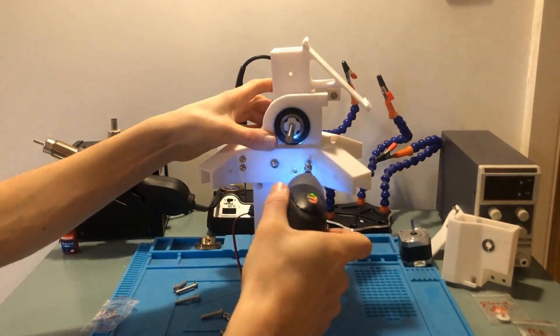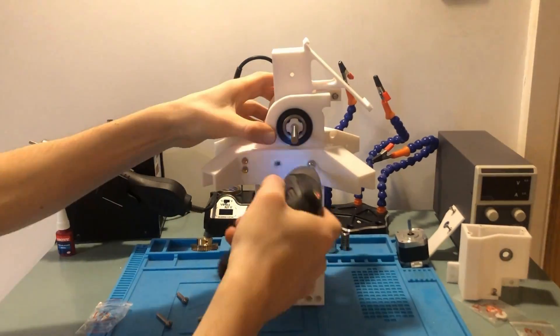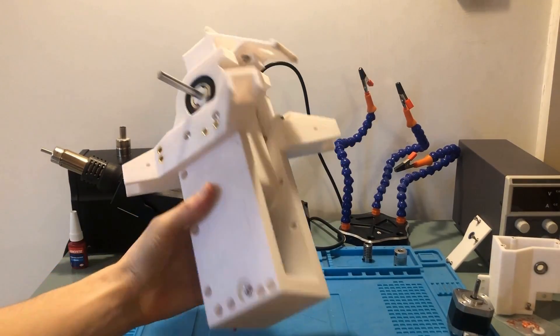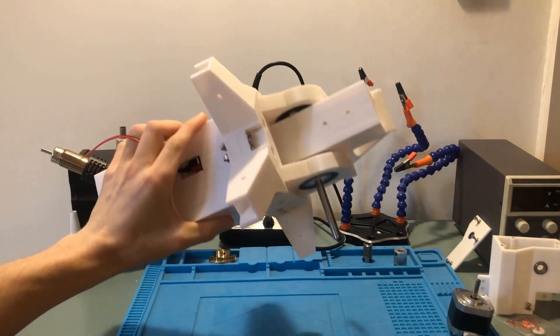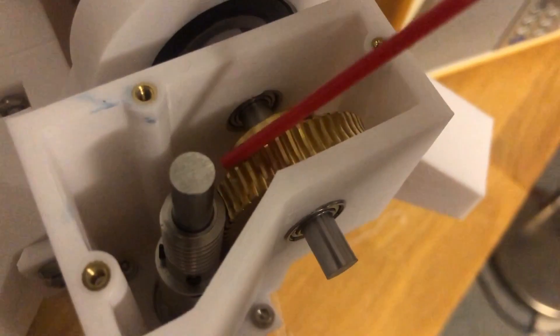The legs of the launch pad, which will be four 600mm long 20-20 extrusions, slot into these fixtures here. The gearbox is then installed on the main 8mm shaft and a healthy amount of thread lock and grease is added before sealing it all up.